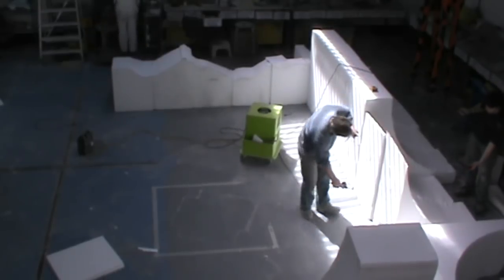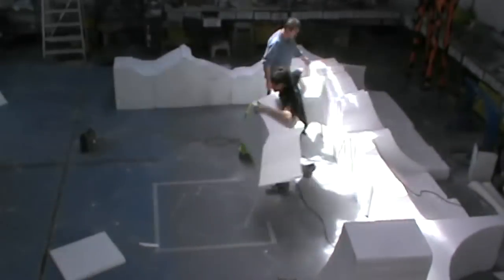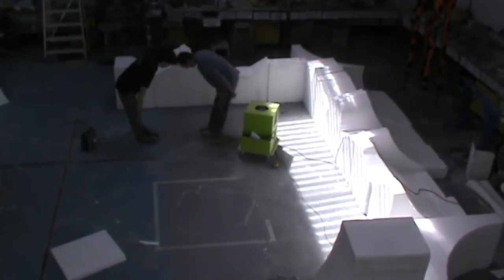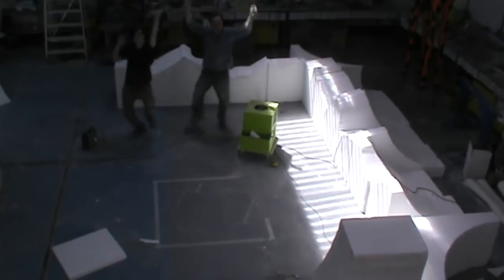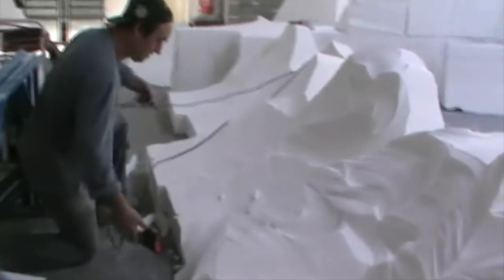In order to get this project underway — as we only had a two-week deadline — we got straight on with blocking out the surround with large billets of polystyrene, and cutting the basic rudimentary shapes from the top. Once we get a real sense of the size and scale, all fully mapped out in the studio, Aidan uses a hot wire and takes the polystyrene off quickly.